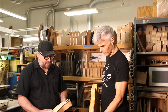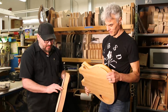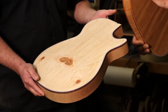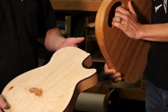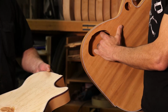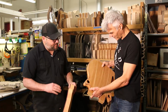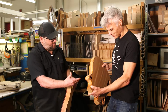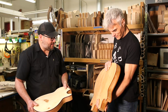All right, so up here in Gretsch, we take a lot of pride in our binding. You can see with this, it's got tortoiseshell binding. It looks like it has 4 or 5 layers of purfling behind it. You can see this double neck here, double bound, gold sparkle binding. It's a showstopper. So is that 3 layers? It gives the impression of 3. The gold and the white are actually pre-laminated, and then it has a black purfling behind it. Makes our job a little easier.